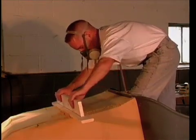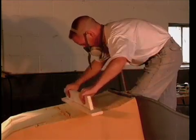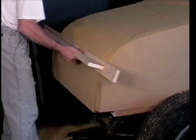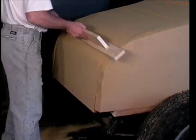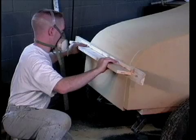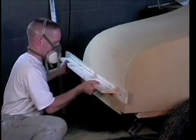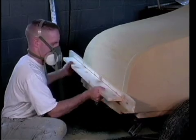Position yourself wherever necessary to keep the block true. If you choose to run the block front to back, be sure both sides of the block progress absolutely evenly. When sanding the glue joints, focus the effort on the glue itself — do not try to tip the block into the foam and gouge it. Move periodically to remove the glue dust, as this can cut away at the foam as well. Soon the foam will be sanded flush with the plywood — stop soon after reaching this point, as further sanding will erode the foam near the wood creating low spots. This occurs because foam dust trapped under the block accumulates by the template and is abrasive enough itself to continue sanding in those areas.